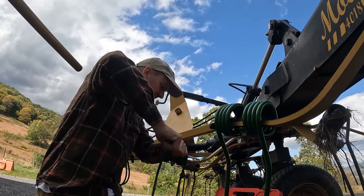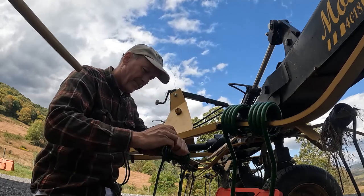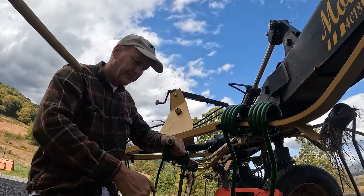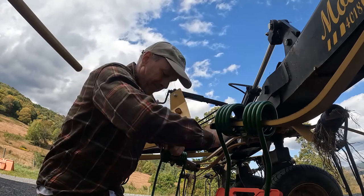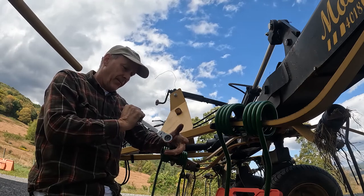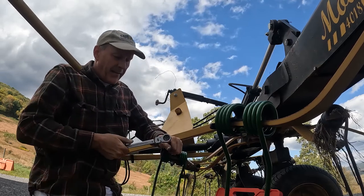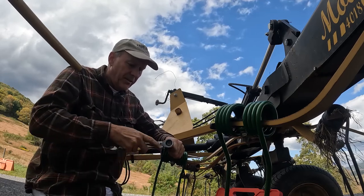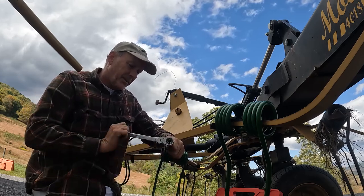There we go. Now you may ask yourself, why am I not using my impact on this? And for sure, I'll break that die. Or tap. I think this is a tap. So I'll probably break that. I don't want to do that. So I just take it nice and easy. And every now and again, when it gets really hard, you just flip it around and go the other direction, just a little bit. It'll let that metal get out of the threads. And you just keep on going.